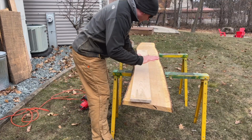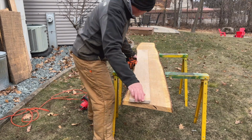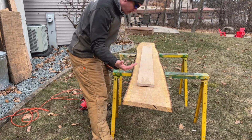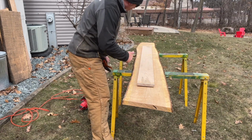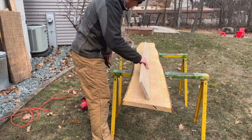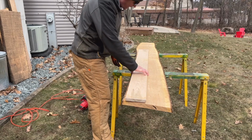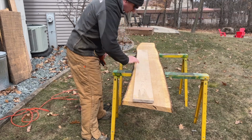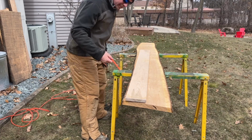Part of the challenge of working with this Alaskan milled lumber, obviously, is you've got two irregular surfaces. So we can't just put this thing through a table saw and clean up an edge, because there's no edge to run against the fence. So we've got to start with one edge, and for this you're going to have to use something like a circular saw. I've got this piece of milled lumber here that I'm going to use as my straight edge, and just try to maximize the wood usage here, find the straightest spot in there and scribe a line with a pencil.